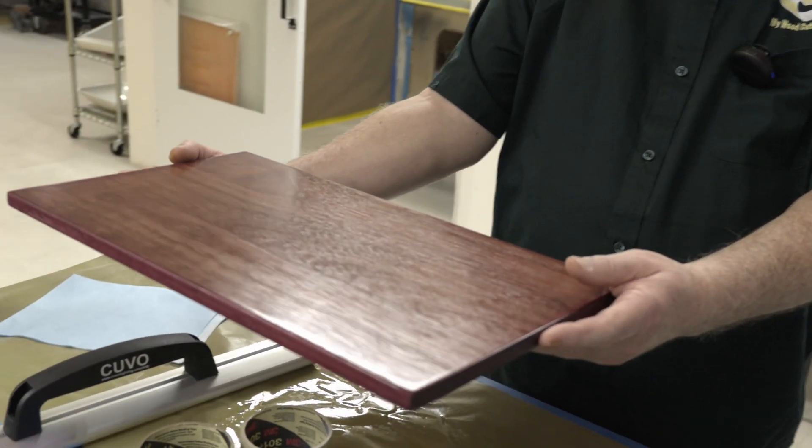I like that a lot. We've got a good load of sealant in there. We need to push down all the excess — most of the grain lines are starting to migrate back up as we push the resin back down into the open grains. The grains are full, so it's actually floating back to the top. Make sure it looks really, really dry — take off all you can. Pretty simple. Now we'll go ahead and cure that — turn the big light on.